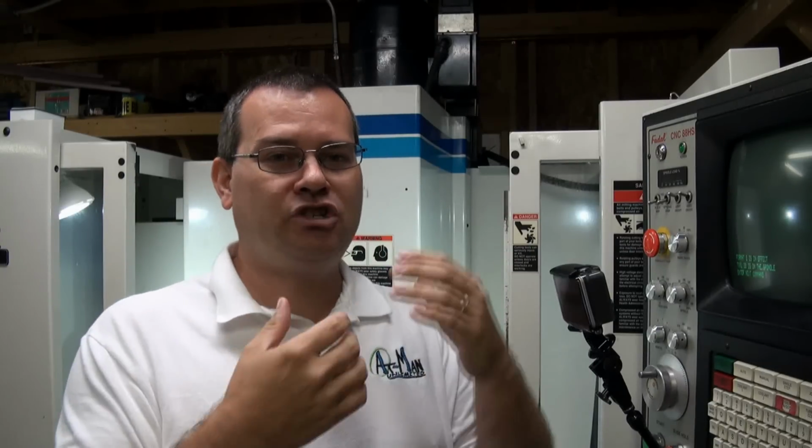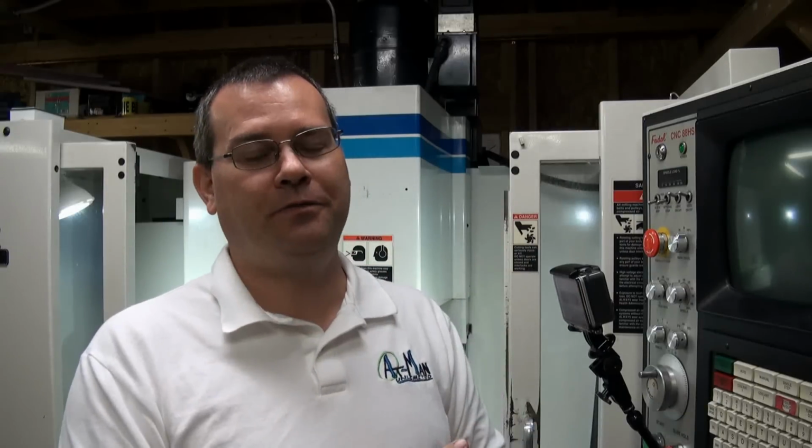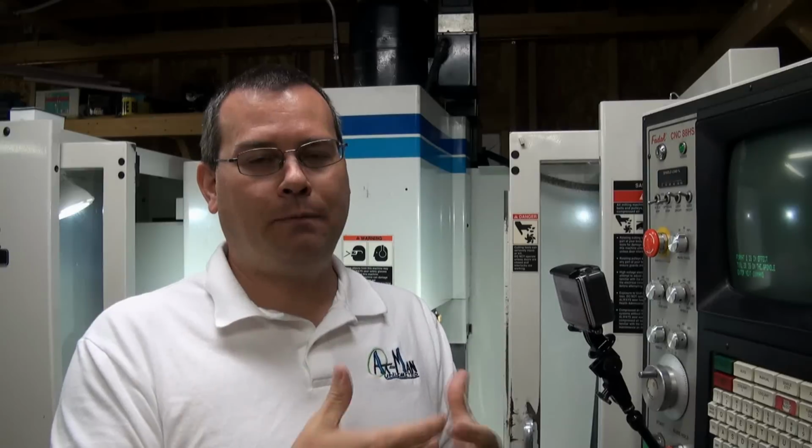And I think it has to do with some character that was generated from the CAM code that the machine doesn't like or doesn't store, and then the way that it does its verification, it includes that character when you go to verify, but it doesn't include it when you go to program it, so then it butts heads and it won't verify. Doesn't necessarily mean the program's bad. I've had it happen on multiple occasions, so keep that in mind as well.